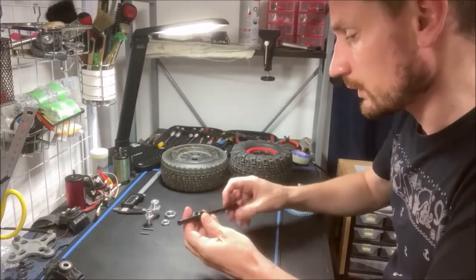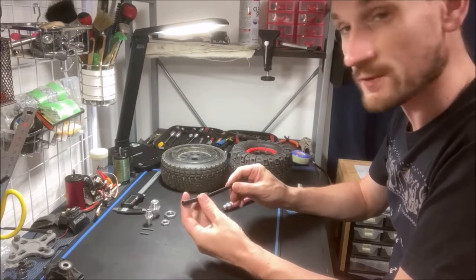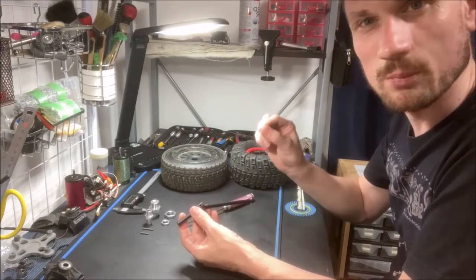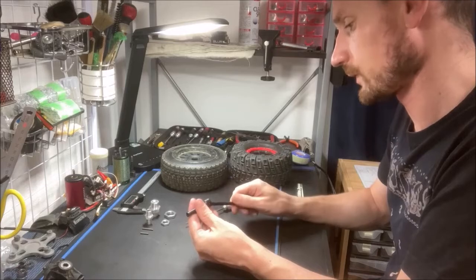Now the pin is captured. As you can see through the hole here — as you can hear — the tolerances are not good enough on this prototype, so this will be fixed by production. I want to have only about a 0.1 millimeter gap around the axle inside.